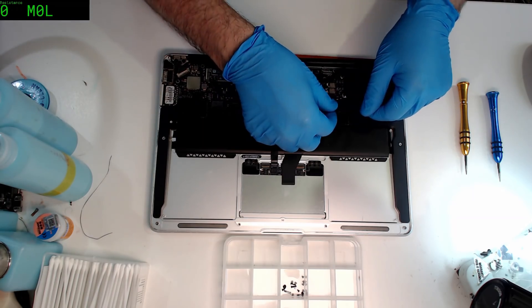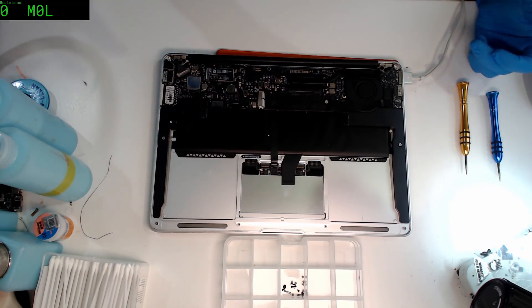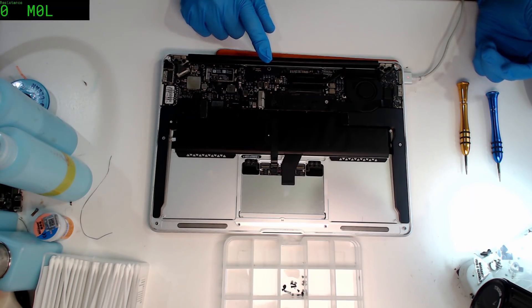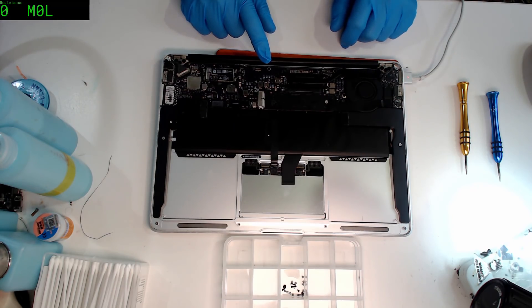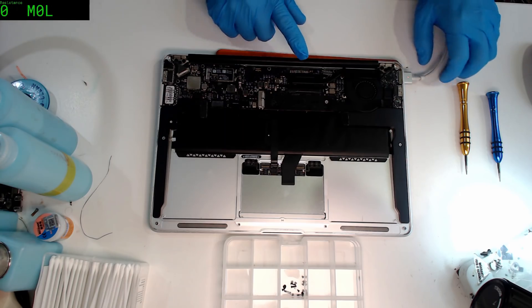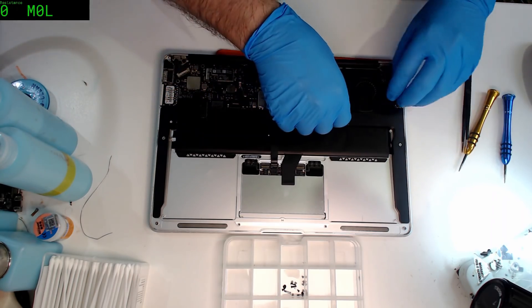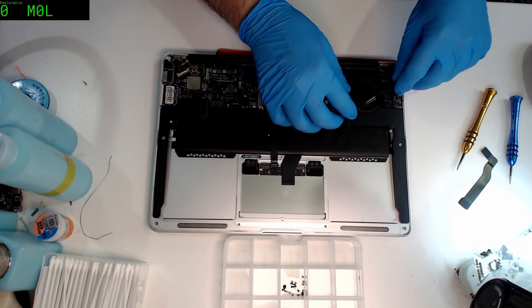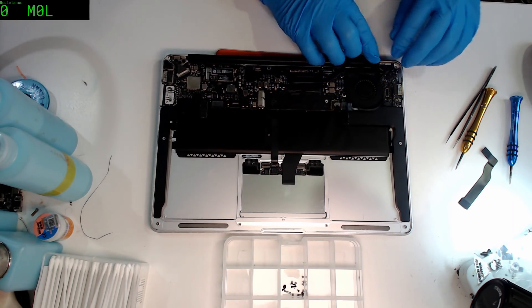I suppose really I should power it up and see what it does. It's very easy to just jump into these projects without thinking. Okay, so I've got green — I've got a fan spin. Now this is a 3437, so it should actually power down on that, but it's not. It's just non-stop. There we go. I wonder if we got clock damage. Sometimes the RTC, when it dies or gets damage, it can do that. What happens is the board starts up and it's waiting around to get some more instructions, gets nothing, so it goes 'stuff it' and just shuts down.